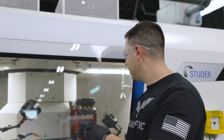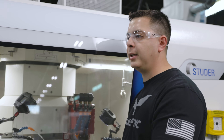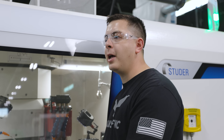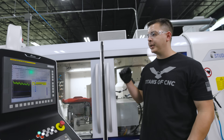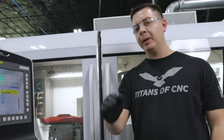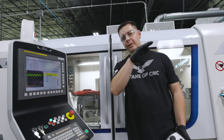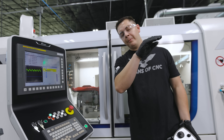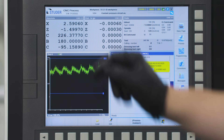Once I hear the ringing go excessive, I need to either slow it down or kick it out. Right now it's grinding pretty good. We've been roughing out material and now it's at its finish cycle — it's plateauing, which is what we want. A nice even stroke on the Sensitron means when it goes to spark out, the spark out is going to dwell on that part, causing the deflection to settle. We need to pay attention as it counts down — we're now at a tenth away, and once it goes to zero the spark out is going to kick on. I gave it a six second spark out.